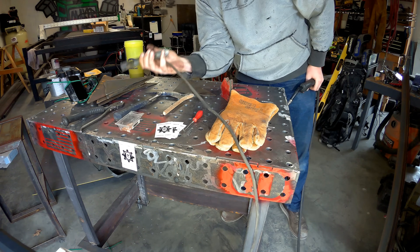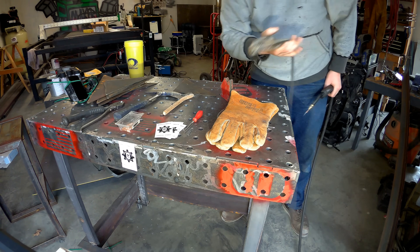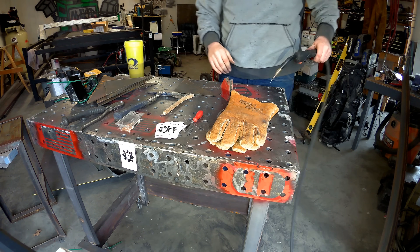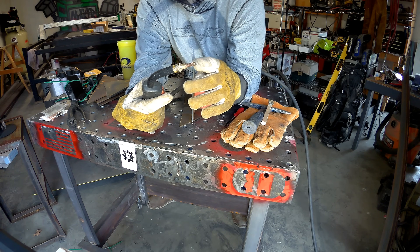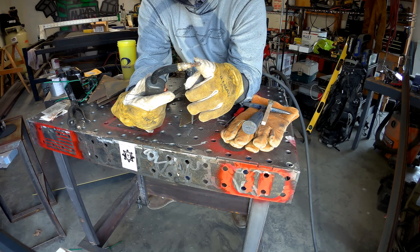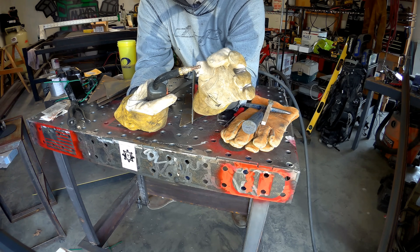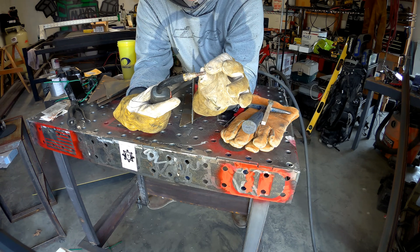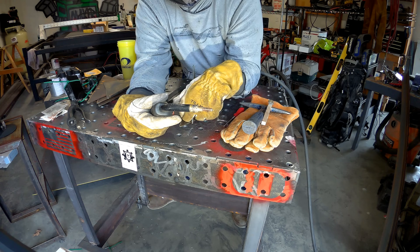My best suggestion for getting started: heat setting at 3 and wire speed up to 50. Turn the machine on and we're ready to start welding. Connect your ground clamp directly to your material, or if you have a metal welding table, clamp it to the table and make sure the metal is touching the metal. The electrode carries electricity through the wire to the piece — you're basically trying to create a short in this connection, with just a little gap so the arc can build up enough resistance to make heat and melt your metal together.